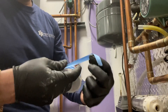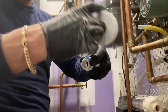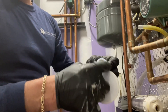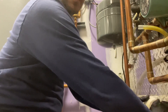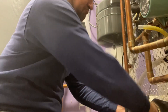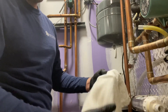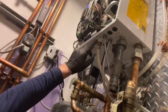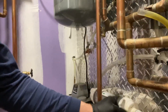There were a lot of great comments on yesterday's video where I used that half-inch tubing bender. Apparently a lot of plumbers in the UK — Scotland and Ireland as well — that's all they do: use a tubing bender on their copper lines and don't use fittings. I never knew that. People were also asking whether it's annealed copper — yeah, it's just regular L copper. So we're going to change that out. I already have my male adapter there, and we're going to come up and put a union here to make this more service-friendly.